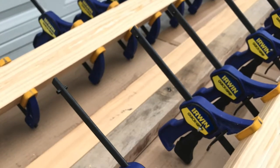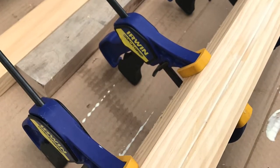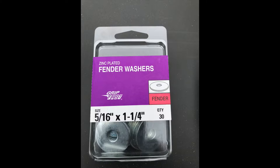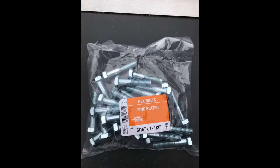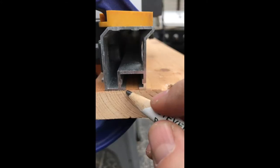Here's what my leg glue-up looked like once I was finally done — again, would have been a lot easier to just use two-by-twos. Here's the hardware I used; please keep in mind it's based on my saw specifically, so you may need something different. I grabbed fender washers, nylon lock nuts, and zinc-plated hex bolts. My next move was to mark the space between the runner underneath the saw so I knew where to drill for the hex bolts.